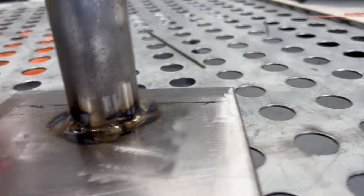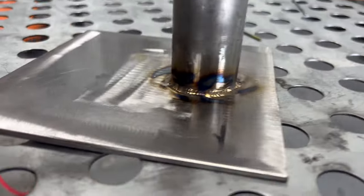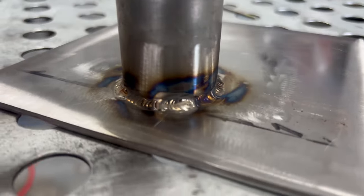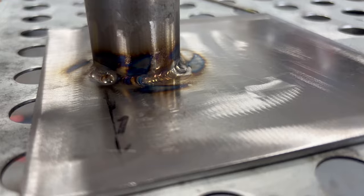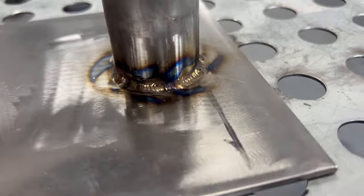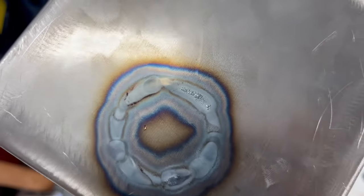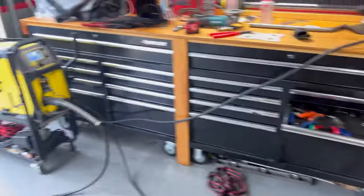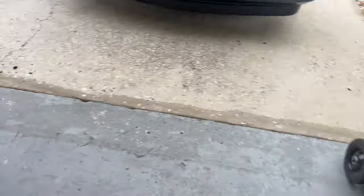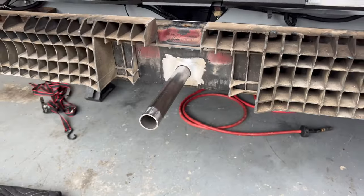I had my phone set up but forgot to hit record, so I missed the welding footage. I think I still know how to weld though — haven't welded in six to eight months. It turned out pretty good: just mild steel, about 100 amps, took my time, probably eight to ten passes, good penetration, a couple of small hot spots but overall pretty happy. We got some TIG welding in too, got the MIG fired up — we got ourselves the start of a chute mount!